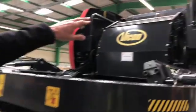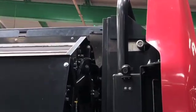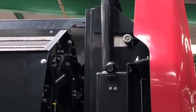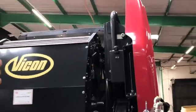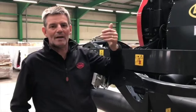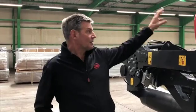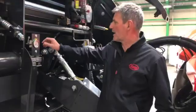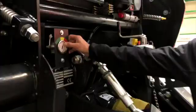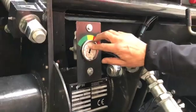Our density valve is positioned just above the valve block — you can see the handle. For wet crops, screw the valve all the way in and then back out one and a half to two turns. For dry crops, screw the valve all the way back out and then back in one and a half to two turns. There's a gauge on the front of the baler to see the setup you've achieved. For wet crops you'll be up to 150, and for dry crops you'll be up to 100 on the gauge.